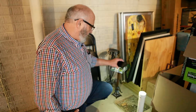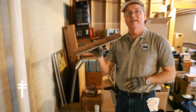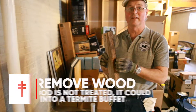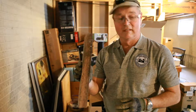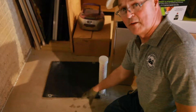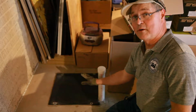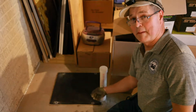We try not to leave the wood exposed underneath shower cutouts and tub cutouts because it is a potential termite source. When I pulled these out, they were actually soft to the touch — water has been soaking into them, making it an ideal termite environment. What I did was create a cover out of black plastic sump material from our trailer. I secured it down to the floor with Tapcon screws, then sealed around the perimeter with silicone caulk. I set it up so that if somebody decides down the road they want to put a tub or shower in, this is very easy for a plumber to remove — just a matter of removing the screws and popping the seal and it will be good to go.